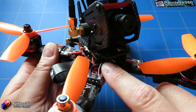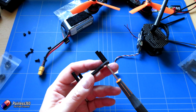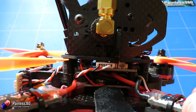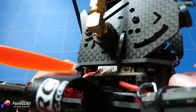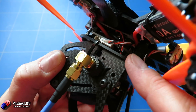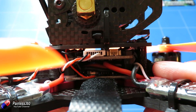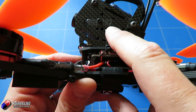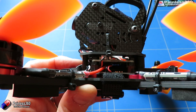To put this together was a little bit tricky. What I ended up doing was connecting the risers — these black pieces — to the bottom plate, and then attaching the bottom plate to the actual FPV pod. The way it's supposed to work is there's a nut and a bolt that goes through the bottom plate to hold it in place. But because it's so limited on room, I didn't want a bolt pressing up against some of the connectors. So instead I put a cable tie through one of these holes through the bottom plate, and that is what's keeping it all together — still lovely and secure.